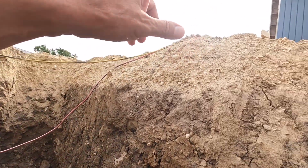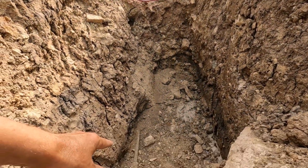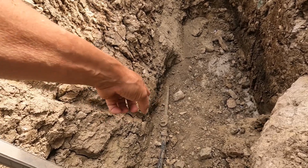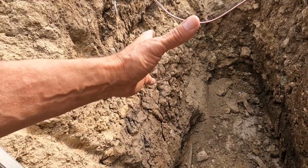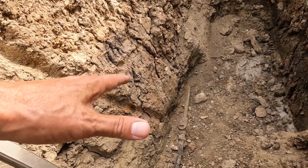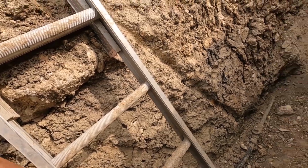What we did was turn off the water up at the well, and he got down here and took the curb stop off of it. Now you could just turn the valve. You could turn that with a wrench. That was no problem. The problem was in the curb stop itself. So we got the water shut off and took that hydrant out of here. We're not going to be using a hydrant over here.